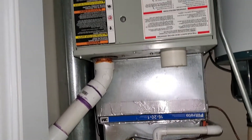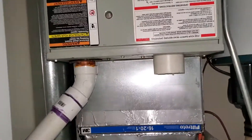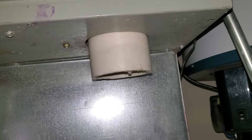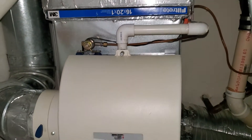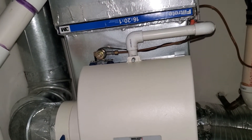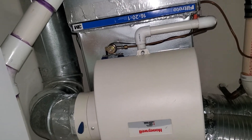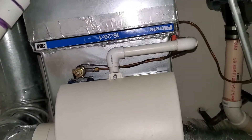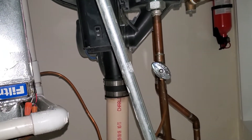We're just going to go down and probably change this out as well, put up a better fresh air intake, make that proper and up to code. We are going to replace the humidifier. Right now we're looking at a large core bypass to do the replacement carrier. Our water line is up to code. We do have an angle stop, so we don't need to replace it with a saddle valve.